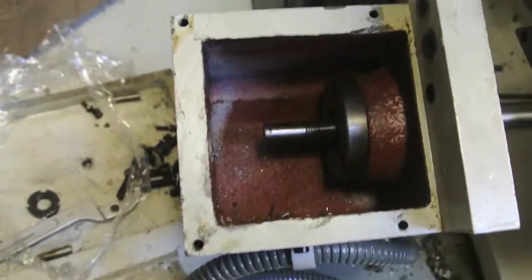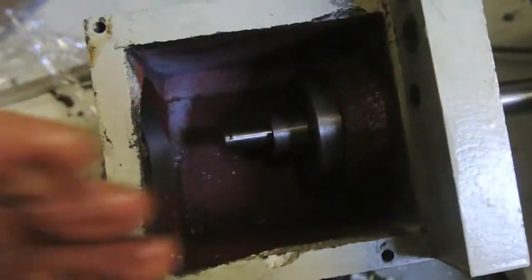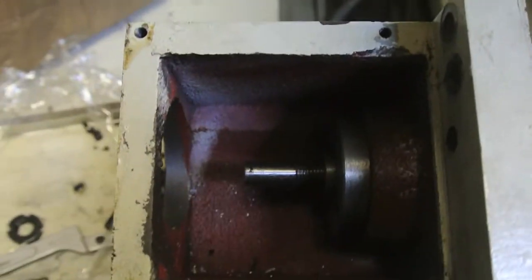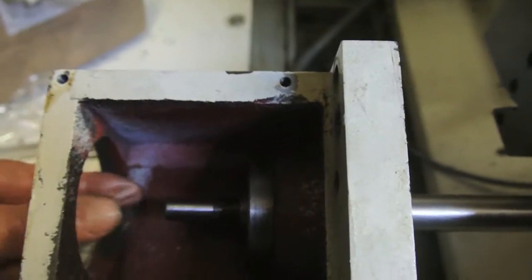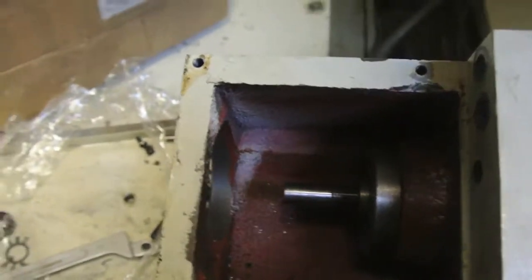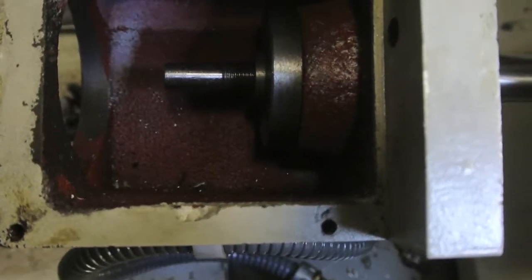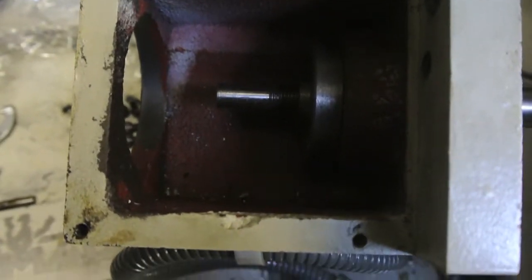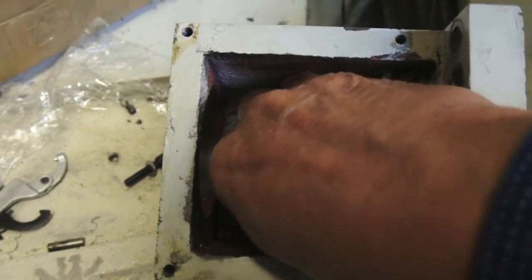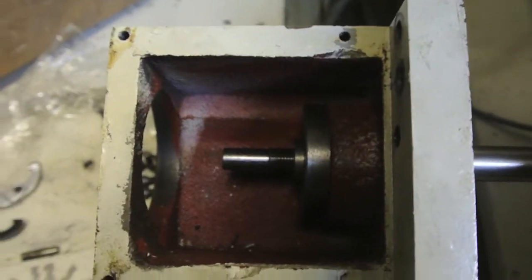There's the ball screw. That's the housing for the stepper and coupling. On the shaft you can see it's closed up and there's a lot more thread there. That thing imparts a preload on the bearings via the little nuts here, which are really awkward to tighten. Tonight, rather than take any risks, I'm going to make a special clamp to go on the end of the shaft with a handle on it. I believe Tormac do this as part of their tool kit. I managed to purchase a couple of C-spanners that fit. I think it's quite essential that you grip that shaft properly — the problem is it's precision ground and you don't really want to damage it. I've been holding it with pliers and I'm not happy about doing that.